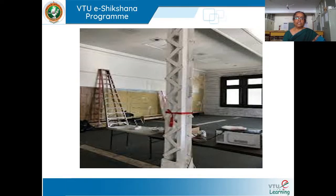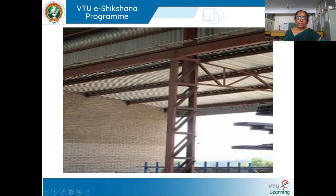In this figure, you can see single lacing — how they have put this column, which is made up of angles. The other side also perfectly will be the shadow of that. Clearly you can see the lacing with the crossbar and the mirror image on the other side. Here the channel sections are connected with the lacings and the horizontal bar.